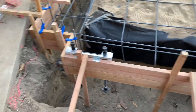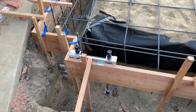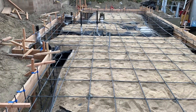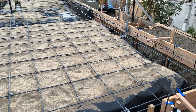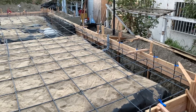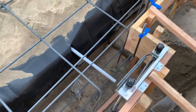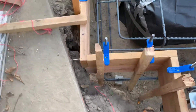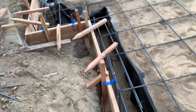Another progress report — they got all the rebar going up and the mat laid on the top end. Now that they've got that done, I can get my conduits where they need to be. I can rise up this conduit here and get it in the wall. You can see they got their threads ready to go on this edge wall all the way across.